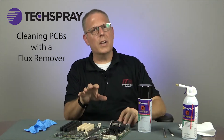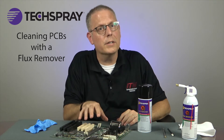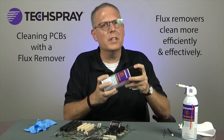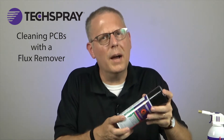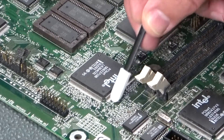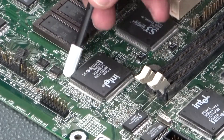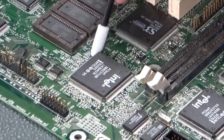Isopropyl alcohol is the most common solvent used for removing flux, but TechSpray offers flux removers that can do the job more efficiently and effectively. One common way to clean flux is to wet a swab with isopropyl alcohol and wipe around the solder joint. This isn't the most effective way to clean a PCB because often it just moves around the residues. Keep in mind that flux residues don't evaporate off the surface with the solvent — residues like that have to be physically removed.